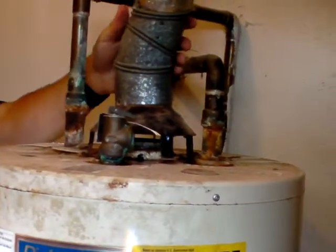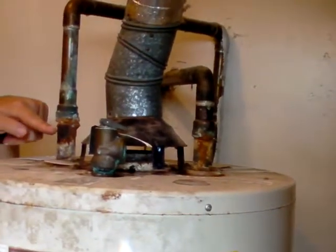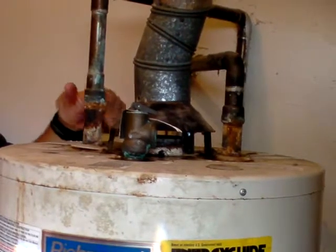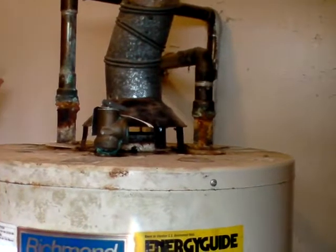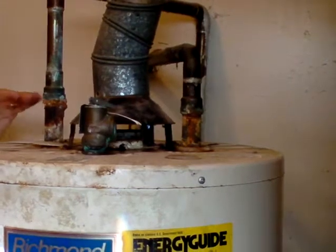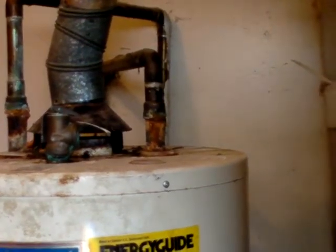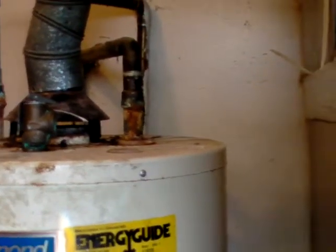Okay, one of the byproducts of this is water vapor. So when you see the lines right around here that are rusting, it's probably not from puddling water, it's probably from spillage. Okay? So we're going to do a spillage test. Even from a visual inspection, what am I guessing? Whether there is or not currently, there certainly has been some spillage. When I walked in here today, it was like that. What's that going to tell you? It's not going up. It's probably, yeah. We don't know for sure until we do the test.